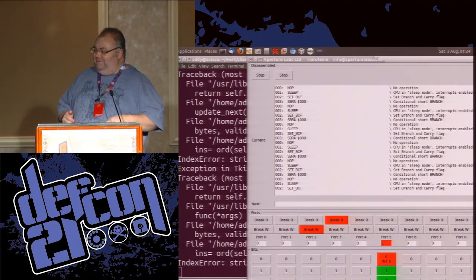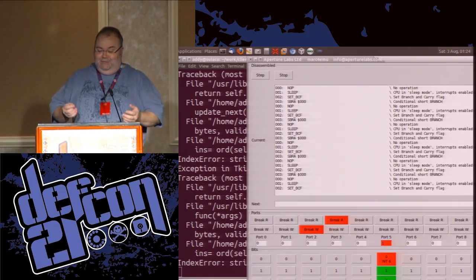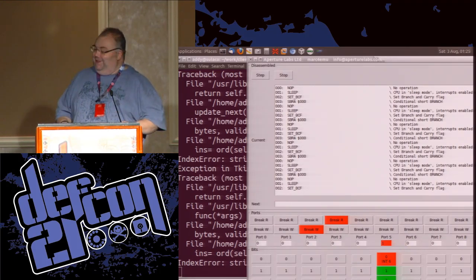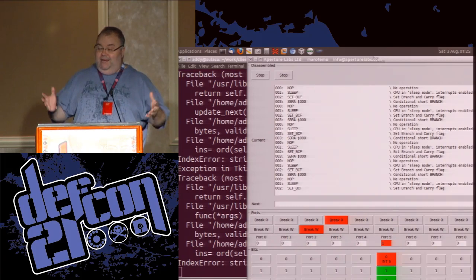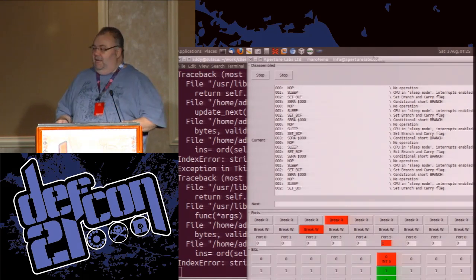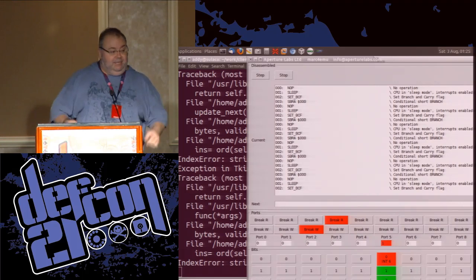No way to read it out, because with Flash you have the ability to read it out, but here it's mask, so you don't need that facility. So it just checks the checksum. Yes, okay. Now that routine gets turned off. The interconnect between the MCU and the EEPROM, again, all inside the package. Yeah, no, that's not exposed to anyone. No one is ever going to get the code off this EEPROM. And it just shows you what you can actually achieve and how really some of their thinking is. So let's take some questions from you guys.